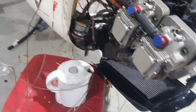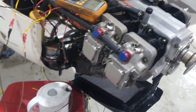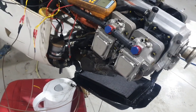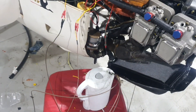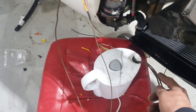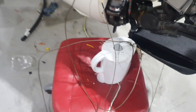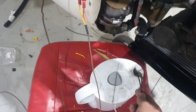One of the things — this engine had four CHTs on it, which is completely overkill. We wouldn't normally bother with that, but because it had them installed I figured we'd get them going. Some of the thermocouples were faulty; in fact, I've replaced all of them so I can calibrate them and get them more accurate. What I've got here is a kettle of boiling water with three probes in it — I'll explain why in a minute.